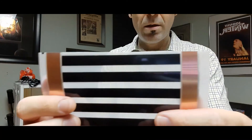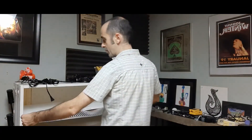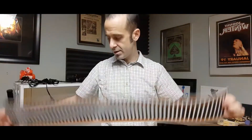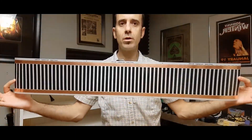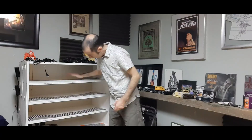I've cut here — see, I cut in between the element, straight down the white plastic, leaving the element intact. Next I measure it — it's actually a little bit long, which is good. Too short you can't stretch it out; too long we'll cut it down. I'm going to measure each strip down to 58 heating elements, so I've got a little bit left over to sacrifice. All three strips are now measured to exactly 58 elements — now it's time to wire them up.